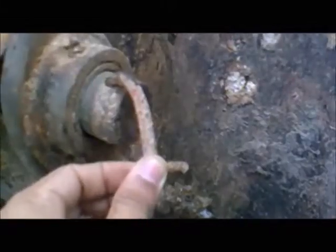Eventually this will result in the failure of the excavator bucket boss side or the dipper boss side. This is not recommended, and proper greasing has not been done here either, which will further increase the wear and tear of these mating parts.